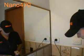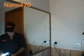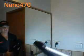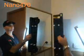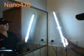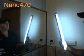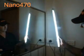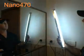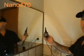Okay, that gives me some kind of an idea. That's where our shelf's going to be. Now we're going to use our light shelf, our Nano470 light shelf here, a device that we've come up with, and all we're going to cure it with is a standard white fluorescent tube, T5, 14 watt white fluorescent tube, and using our Nano470 White Light High Strength Adhesive.